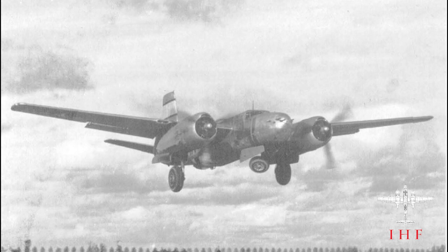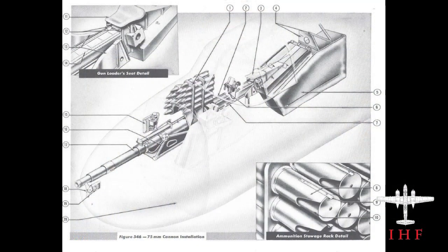That rotational action was the direct result of why so many early Invaders crashed with nose gear collapses. The gears either did not fully rotate forward again, or they didn't lock into position and failed. Douglas did redesign the nose gear somewhat to help combat this, but those changes did not go into effect until several hundred planes were already built, and those changes were still prone to failure if pins were missing, damaged, or the hydraulic system had a leak.